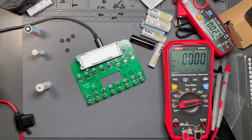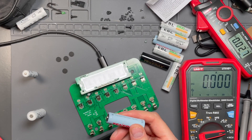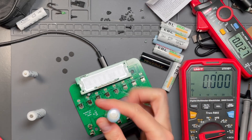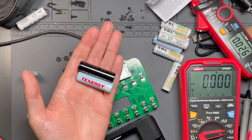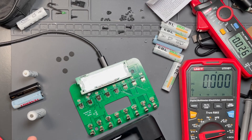This is a good charger. It's not the best out there, but it is quite good for the price. These standard Tenergy cells rated 2.5 amp-hour have been pretty good — I've used them for a year with no issues. I don't think Tenergy manufactures their own NiMH cells; there are fewer and fewer manufacturers right now, and these may well be white-label. The Tenergy Premium Pros also work quite well. The Tenergy rechargeable battery combo does everything it says and didn't claim features it doesn't have. It's a pretty honest charger — that's what I'd like to see.